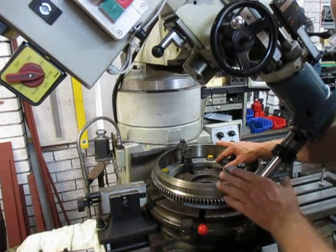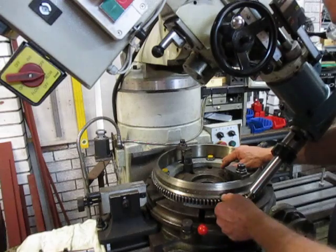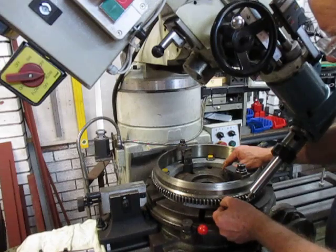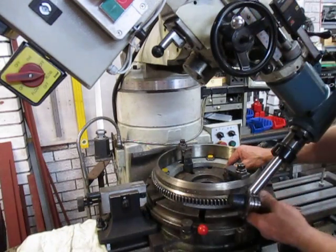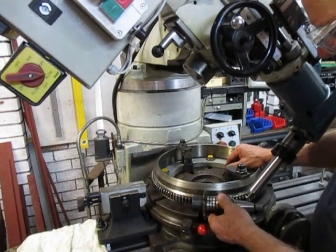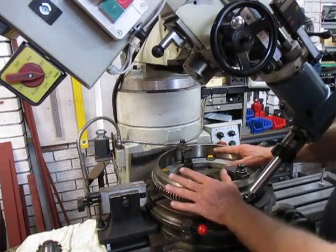What I've come up with — we're not going to work on this at the moment. This is just a setup to show how it's going to be set up, because it's got to go to the lathe for me to cut this land down to that point. Once I've done that, I'm going to fix up those five teeth that are damaged, and then I'll trim those teeth up to the right profile with the involute cutter.